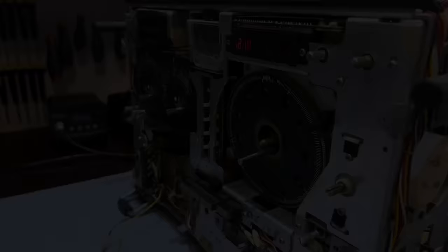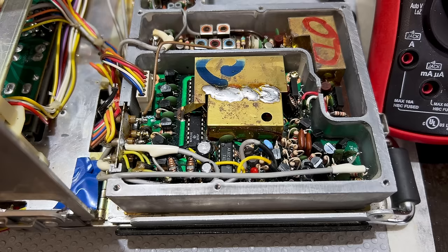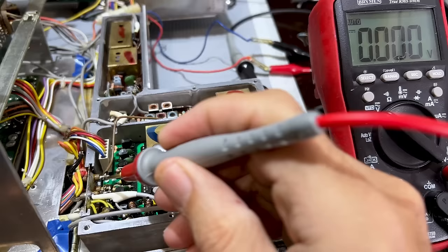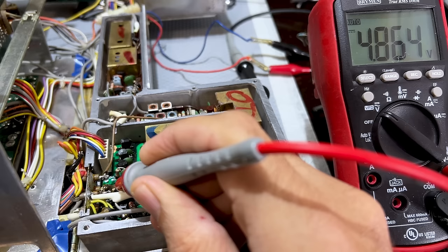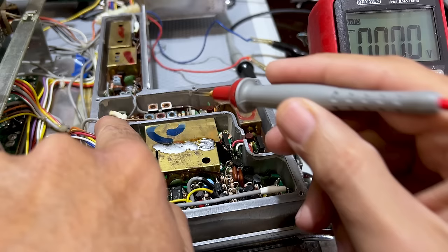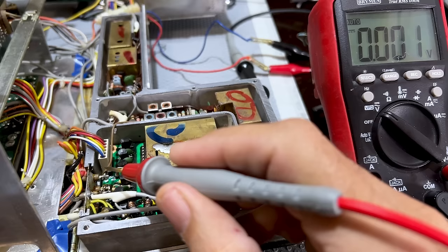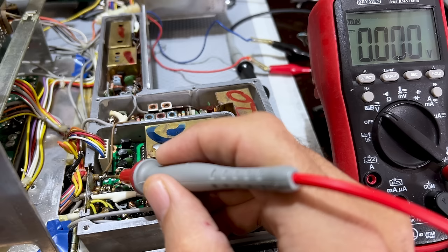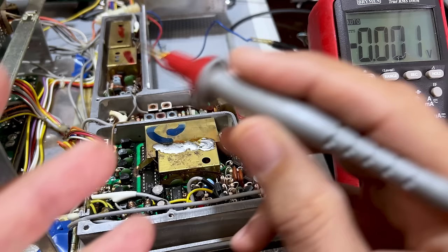The problem was I was still not getting anything on shortwave except a mild hiss, even at lower volume. So I decided to check for voltages. This time I got lucky - this point is meant to be five volts and we've got 4.8 something, which is fine. But this brown wire is supposed to be 12 volts - it says so on the board - and when I measured it, I got five volts, which was rather weird - exactly the same voltage as the other point. I couldn't figure out what was going on. I checked the schematic and I'm supposed to have about 11 volts there. So I decided to flip this thing up, and as I flipped it up, I heard a change in the audio volume.